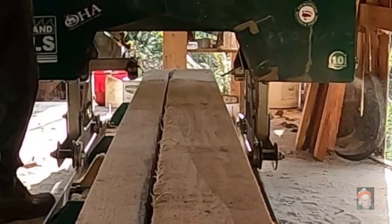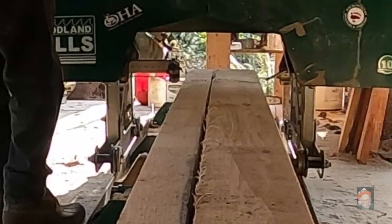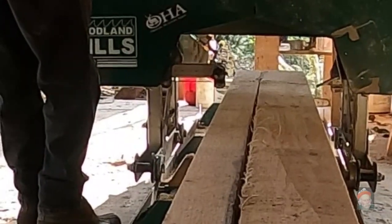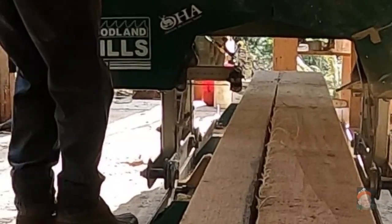What I'm doing here is skimming the top off both of these so the remainders will be evenly divisible by 1.5 inches when finished. No, this isn't a fancy panning camera shot. I just set the camera down on the cant and it's vibrating.